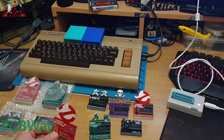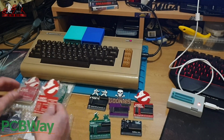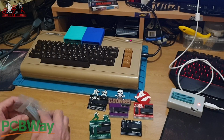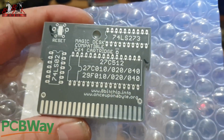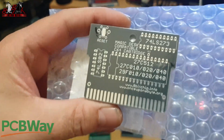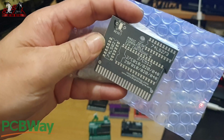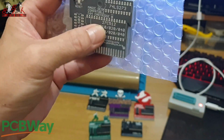So I've already made some on here and I've shown you how to do the Ghostbusters one in the past in another video. So what I'm going to do is move these out of the way for the minute, and we're just going to concentrate on one of these boards here, which again, as you can see, they're exactly the same, although this model you can get from PCBWay. All the links for this board you'll find in the description. You just go on eBay and order an LS273 and a 74LS02, and then you can get your chips that you need, or whichever you want to do.